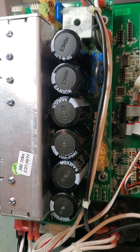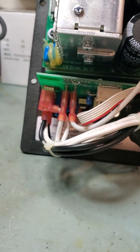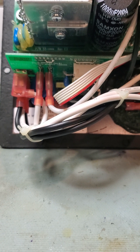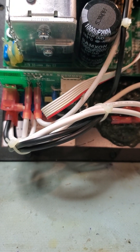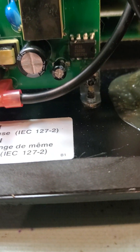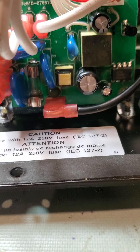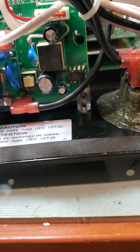The quicker thing to look at if you're having power issues with the unit is there's a board down here where your 120V comes in. It has an onboard switching regulator as well as a low dropout regulator, and I think the best thing to do is check this out first. It has this switching regulator — a little 8-pin DIP, U4 — which takes fully rectified line voltage and produces six volts DC.